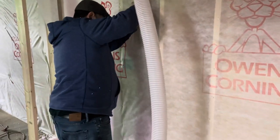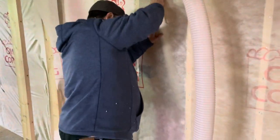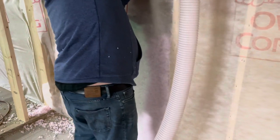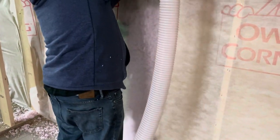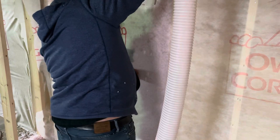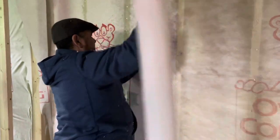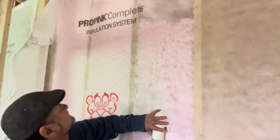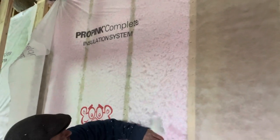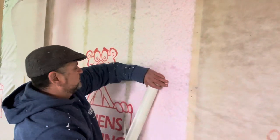We need to use a back-and-forth motion here. What it's doing is actually going to puff out. We want a certain density here so it's not going to just collapse down. We get to about the middle and then go all the way up to the top. The top is blocked off — we put some fiberglass batts in there that allow some air to get through. We continue to move the tube down until we feel the proper density, then cut it off.